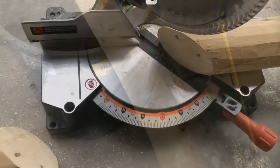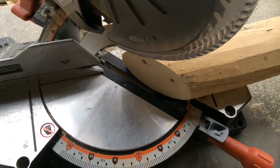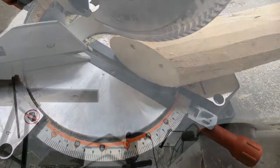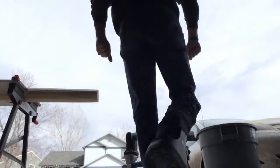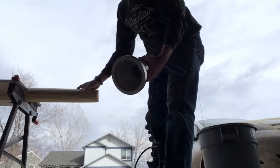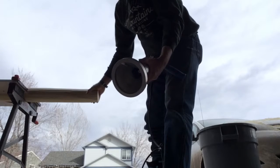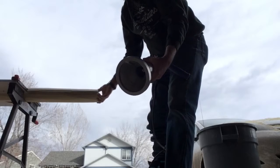So I just made the cut on the long length of the log at a 45 degree angle. Hopefully that'll be about right, but now we'll be cutting the 79 and 3 quarter inch lengths. What I'm about to do is start cutting the tenon for the upper portion of the banister. I have my tenon cutter set up — this will handle about a four and a half inch log. I did have to trim this piece a little bit for it to fit. This tends to be a challenge when you're doing it by yourself, but I'm here by myself today, so we'll give it a try and just take it slow and easy.